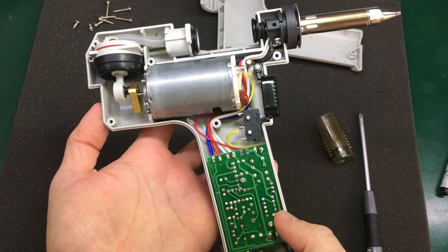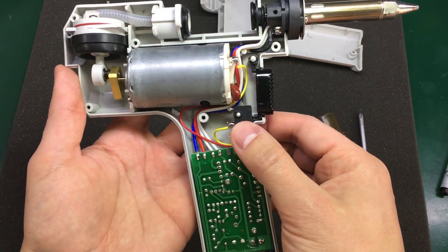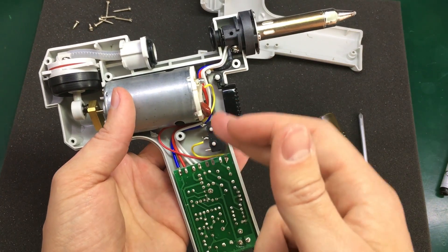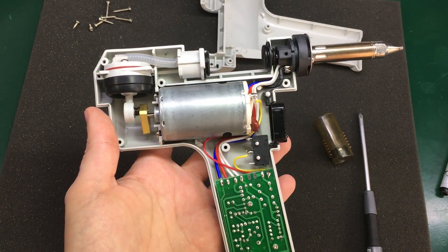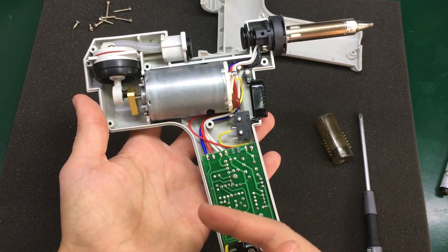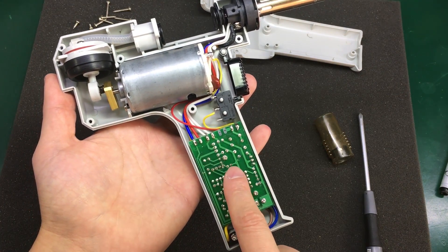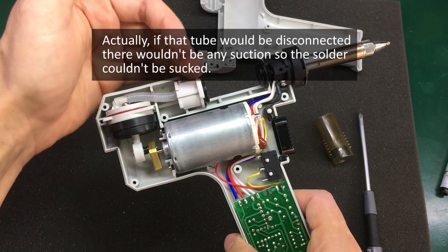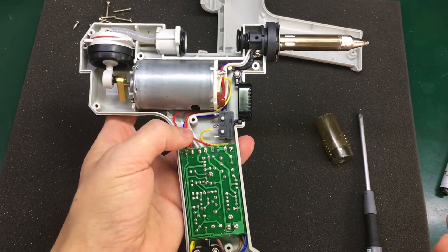So apart from the crusty soldering job, the overall interior construction of this soldering pump is pretty safe to use — I'm not seeing anything that could cause a problem. You could complain about the non-isolated terminals on the switch and motor, but as it is, it will not cause any problem. The board I saw blown up online could have happened if solder balls reached the interior of the enclosure and caused a short circuit, or it could have just been a bad unit from the factory. But mine looks just fine.